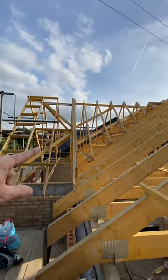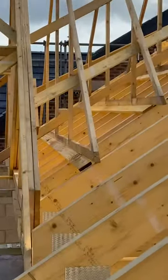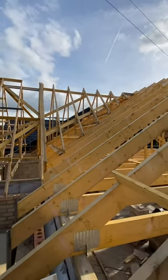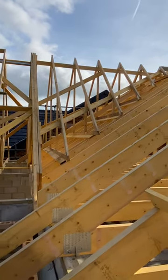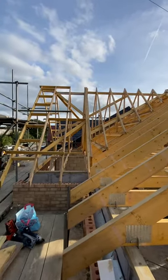Our rake, as I explained the other day, is coming down. All our slip braces are in as well. Once the roof is loaded — as I explained in the previous video about diminished valley set — because they're only spiked into the main roof structure, they're just an extra contingency to stop any movement slipping down the roof.